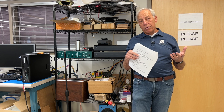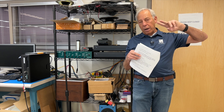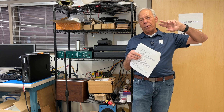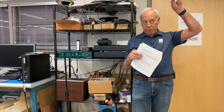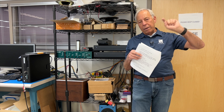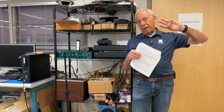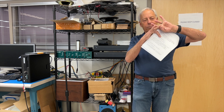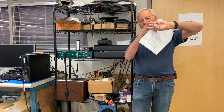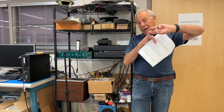Because really all they're doing is taking the XLR, which has two conductors, each out of phase with the other — out of polarity. One's going up while the other's going down. They're in sync, but they are doing the opposite. And a ground wire, so you've got three wires. It's real easy and simple to just eliminate one of those wires and just have one signal wire — the positive going signal wire — and ground. That gives you single-ended.